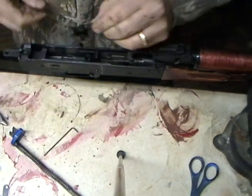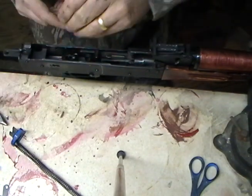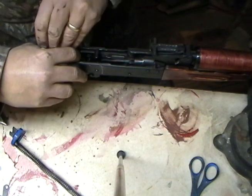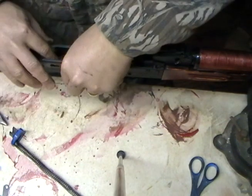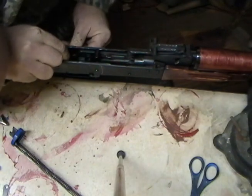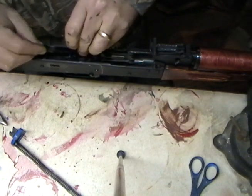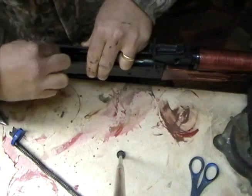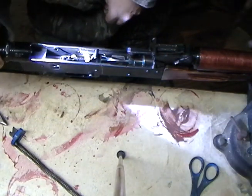And you're going to drop your trigger assembly down inside there. And then you're going to pull your springs over the edge of your trigger assembly. Okay, like that. Put your pin back in. Kind of rhymes, doesn't it? Okay, then you're going to take and put your keeper back in. This is your pin retainer and keeper assembly. I want to make sure that that is definitely seated in, and it is.